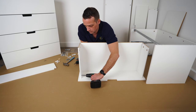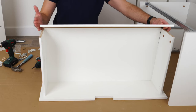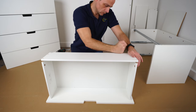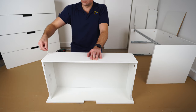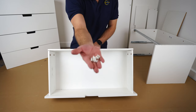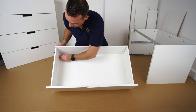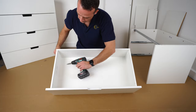Back panel: there is a gap at the bottom. Place it in the same way as the bottom panel — not straight 90 degrees, maybe 45. Don't push it all the way yet — make sure it's inside, then push it all the way. Some go easier, some go a bit harder, but everything should go in smoothly. No force. Now the two locks on each side at the back of the drawer — secure them by twisting to the right side. All arrows on the locks pointing to the hole at the front.